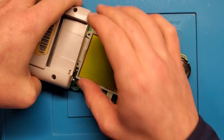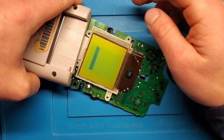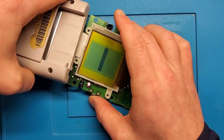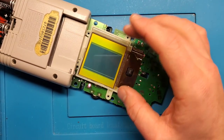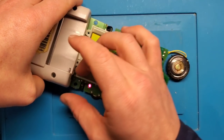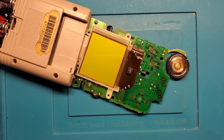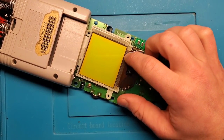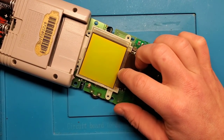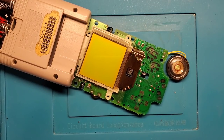This switch will turn it on and off, so I should be able to turn it on and as you can see the screen will show up. For this purpose, I'm going to turn the contrast wheel all the way up so it looks like that — a big black square in the middle — so I can very clearly see what works and what doesn't. The next step: right underneath the screen there's a small adhesive piece which I need to get up, so I'm going to use some small tweezers and just lift this up.